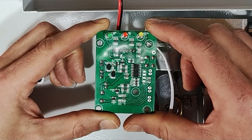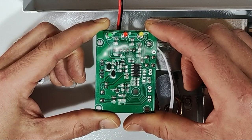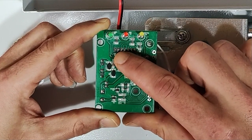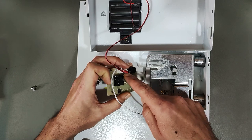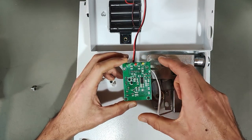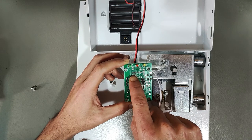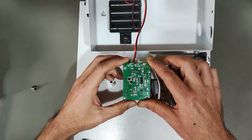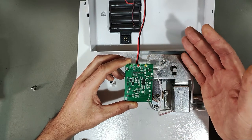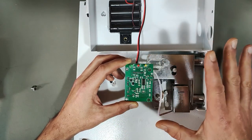The deal is that when I opened this thing up, what I discovered was that it looked a bit like this. This happened several months ago, so I had to actually clean off the schmutz. This is actually virtual schmutz that I've superimposed on it just to give you an idea of what the problem was. You'll notice that between these two pins here, there was quite a bit of schmutz. What I did is I actually took the little circuit board, disconnected it, took the batteries out. Once it was disconnected and not powered, I used some contact cleaner and a little paintbrush and made sure I got all the schmutz removed. You can use contact cleaner, which evaporates quite nicely. You can also just use rubbing alcohol - dump some on when it's not powered, use a brush like a paintbrush, and scrub it until all that schmutz is gone.